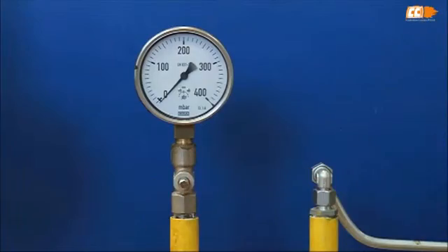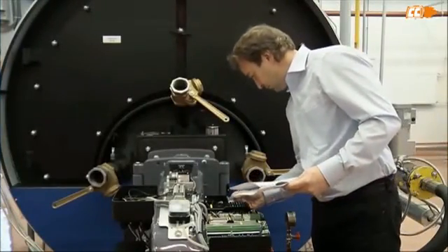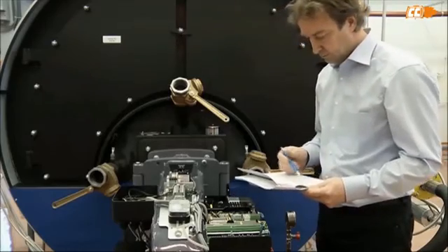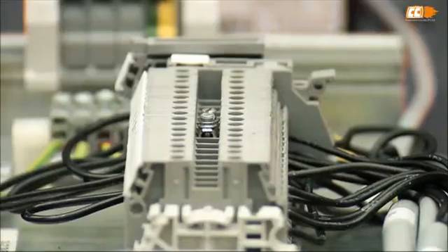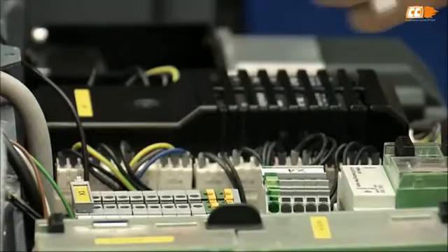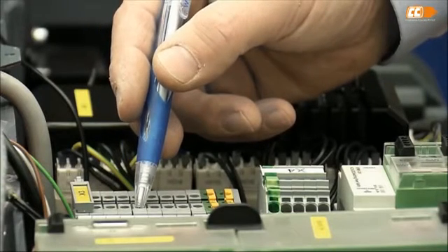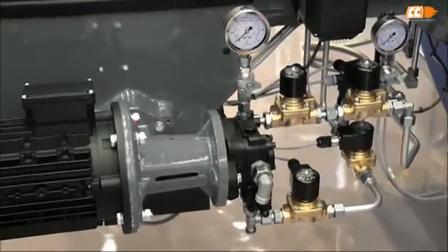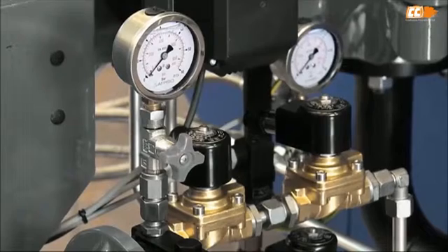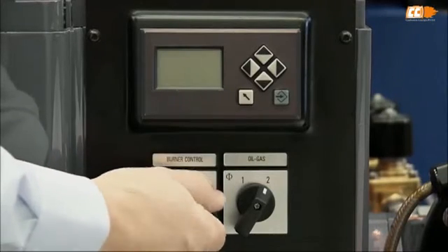Using the pressure gauge, make sure that the fuel pressure is adequate. Check that electrical connection points, inputs and outputs, as well as the motor rotation direction, are correct. Burner control system monitors the input and output and the bus interface. Improper connections cause burner lockout. For oil use, the oil booster's oil pump must be vented and the oil filter installed. Now you can switch the power on.